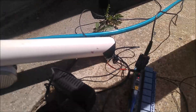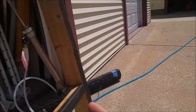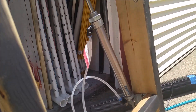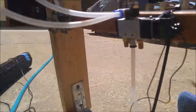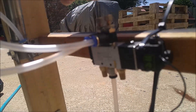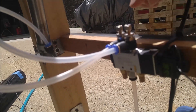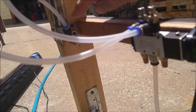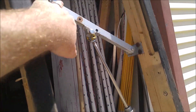The heart of pneumatics is of course air. I've got a line coming from my compressor to work here and that runs this cylinder here. At the current state there's one valve right here — it's got an air inlet at the bottom. This valve at rest is allowing air to push through one of these tubes here at the bottom of the tube, and that fills up the chamber which pushes the piston out, which is holding the armature up to keep the panel up in place.